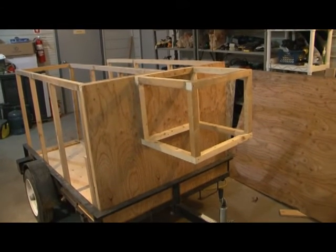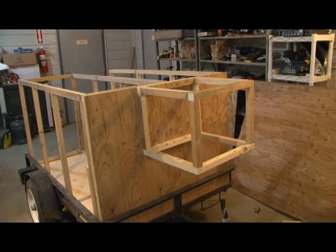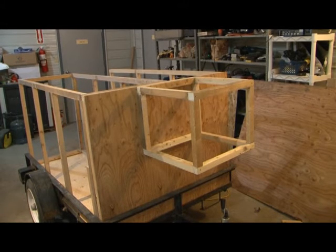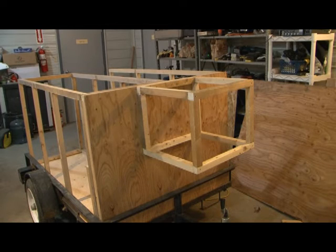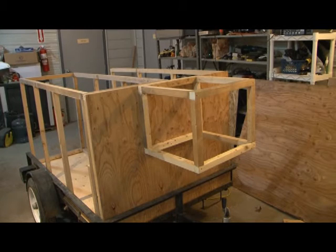What's gonna happen here is we're gonna sheet that in when it comes time to complete that cooler. Then on the inside, like I said, we're gonna run 1-inch styrofoam insulation. And we'll use insulation in the can, the spray insulation, to do the joints, like in the corners, along the bottom, stuff like that. We don't want any gaps.